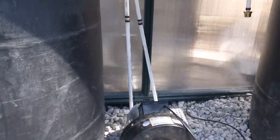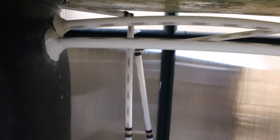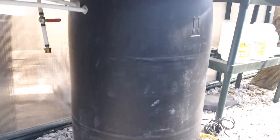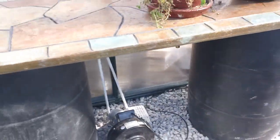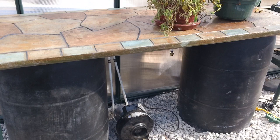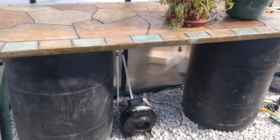Step over so you can see — the water coming up through underneath the foundation here, the PEX is coming up and goes into this barrel here on the left. When that barrel fills up through this pipe, it drains into the barrel on the right. There's a fish pump in the bottom connected to PEX pumping out water. There's a drain valve here to let it drain out and it goes back around the coil. So we've got two black plastic barrels with 100 gallons of water. 100 gallons at 8 pounds a gallon is 800 pounds — five times the equivalent in rock is 4,000 pounds of rock for thermal mass in this little greenhouse.